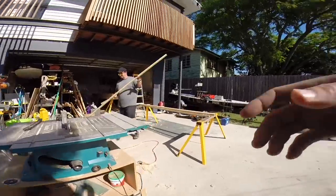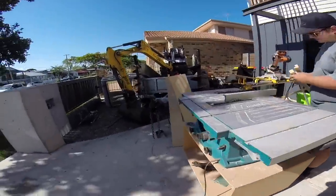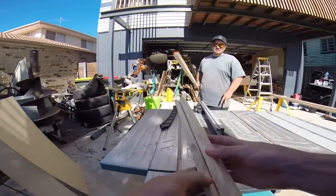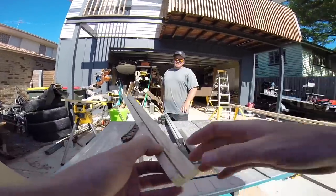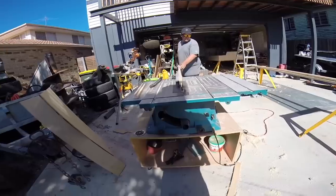Sensational. Right, so we're just cutting our lengths of wood. This is for the hatch rails. Yep. This is our hatch rails, so we're just cutting a 10 by 20 mil groove into the rail using a table saw. So 10 by 20, and we're just doing 4 lengths, and then we're gonna chuck it inside the boat.